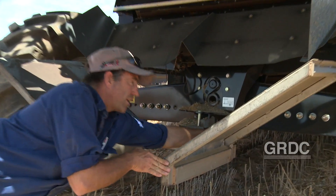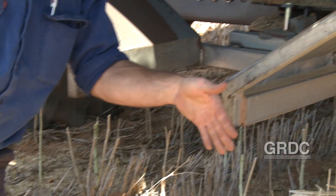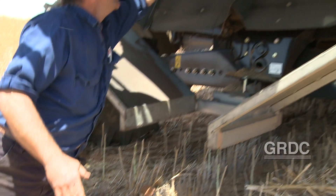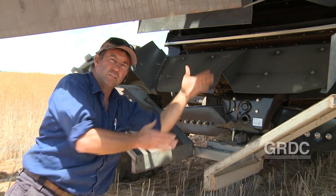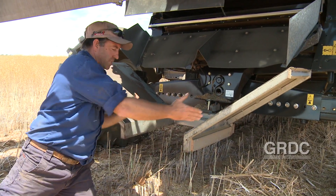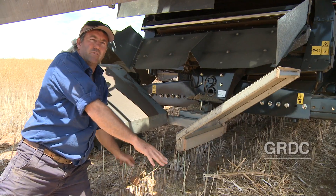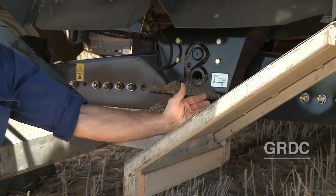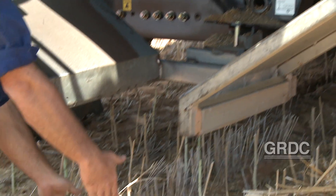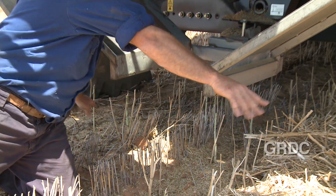This distance here from front to back — these are at 600. I reckon 800 would be better, because where it comes off the beater, some headers throw it back here so it misses the windrow. It still sort of gets channelled into the row, and you still get probably 80% of it. But if you can get what comes off the beater to hit the back of your chute, obviously it's all going to be confined into that half-a-metre row, and there's no escapees out to the side.